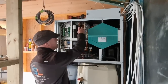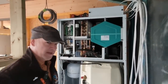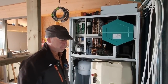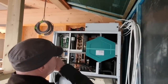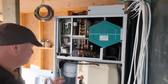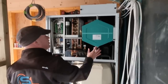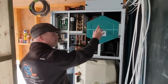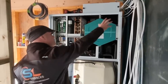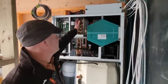You can see the size of these coils - your coil on your heat pump or air con chiller is that wide, that tall, and that deep, but of course that's dealing with much lower temperatures. This unit is always dealing with 20 degrees from inside. So on top of there you have four chambers. Your used air from the house - the dirty air from kitchens, bathrooms, shower rooms - comes into that port, goes across through this exchanger. It's only 80% roughly efficient on purpose, because we can't strip all the energy out of it like a traditional MVHR - we'd have nothing to put over the evaporator. So we take 80% of the energy out there, but we've still got a few degrees on there to charge the fridge, compress it, and then charge this.